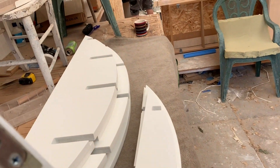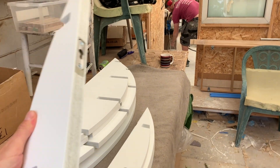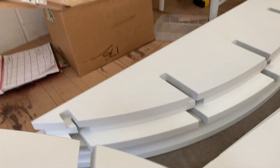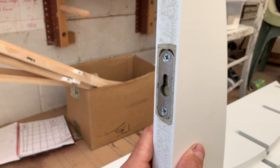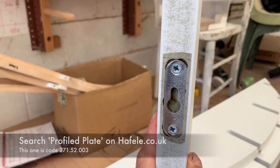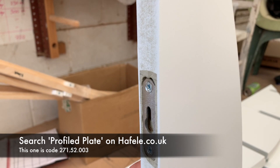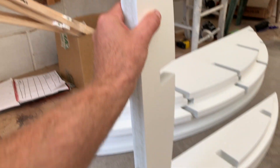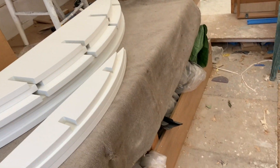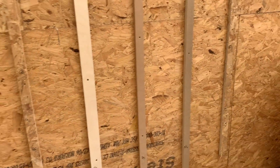I'll drill all those points. They will then line up with fixings on the back of each vertical piece. So this is one of the side verticals upside down. That is a keyhole fixing plate — a hanging plate from Häfele — that has been screwed in with Confirmat screws. They're quite beefy, dowel-like screws that were pre-drilled so they don't split the MDF, because of course they have to bear a certain amount of weight.